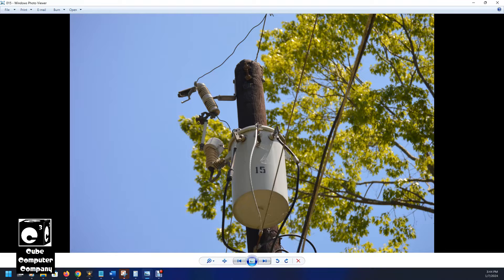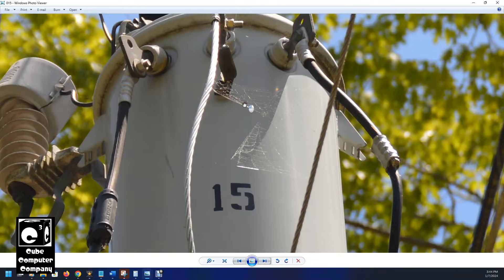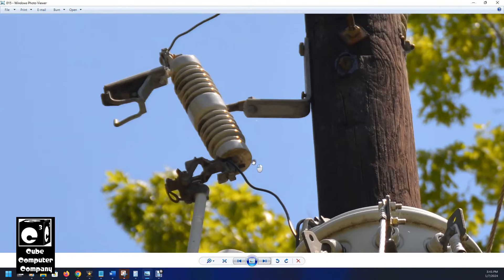Also, this transformer is not a CSP-type transformer. If you look up here, you'll see there is a cutout with a fuse in it — the fuse is actually pulled open, because this transformer used to power my home when it was at its former location, and this picture was taken right after I had Duke Energy disconnect the service. This is a 15 kVA transformer made by Howard Industries. Looking at the secondary tap on the left — that's not right. This actually came loose, and believe it or not, this transformer was still in service in that condition. So that transformer definitely needed to be taken out of service and repaired.